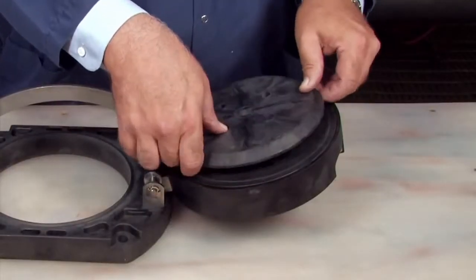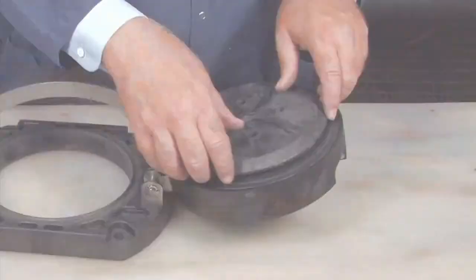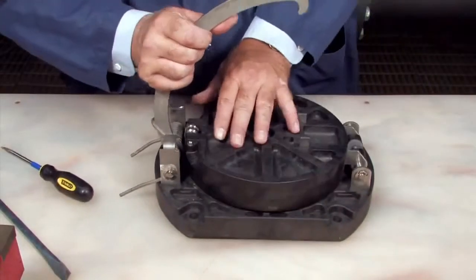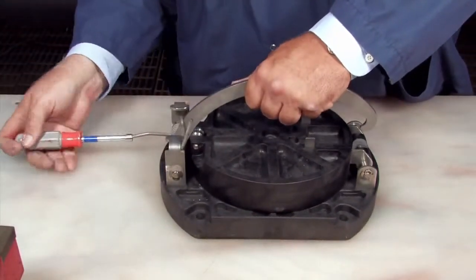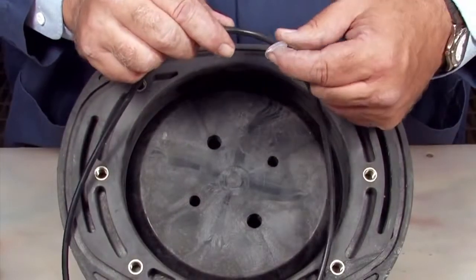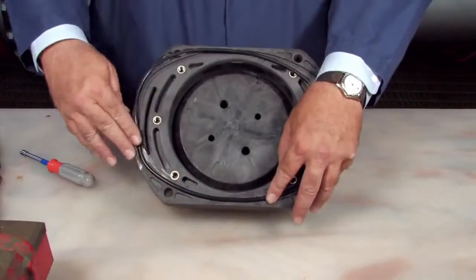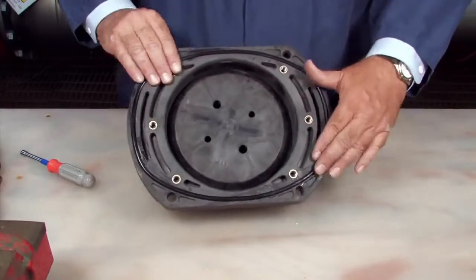Re-thread the retainer plate and tighten. With the check cleaned and repaired, replace the torsion springs. Prepare the checks for reinstallation by cleaning the O-ring groove and thoroughly lubricating the O-ring with an FDA-approved lubricant. Lubricant should help to keep the O-ring in place during reinstallation.